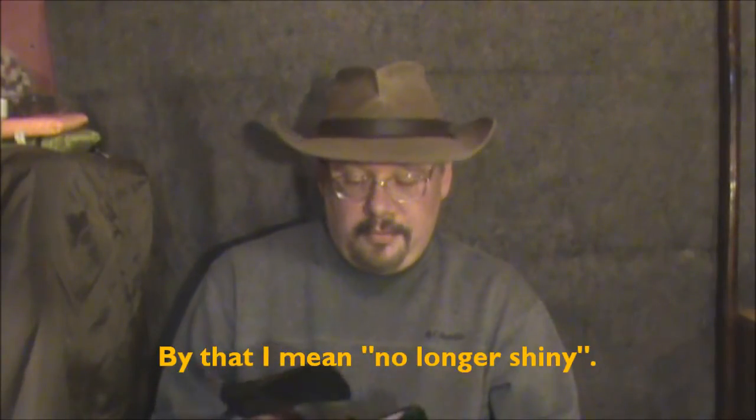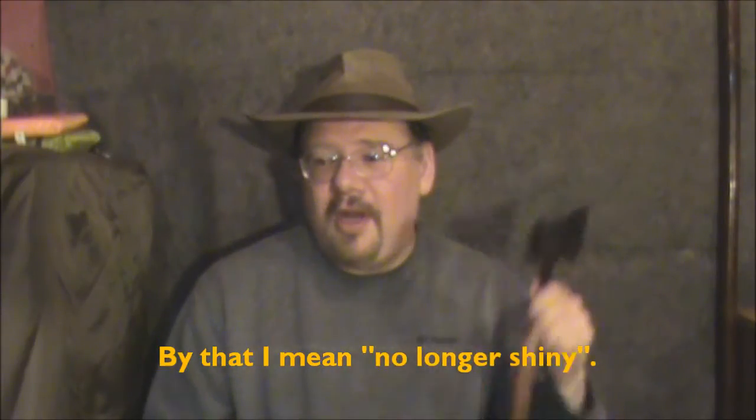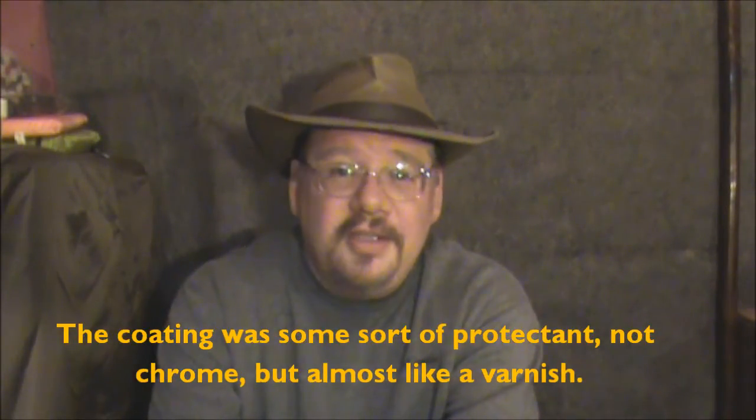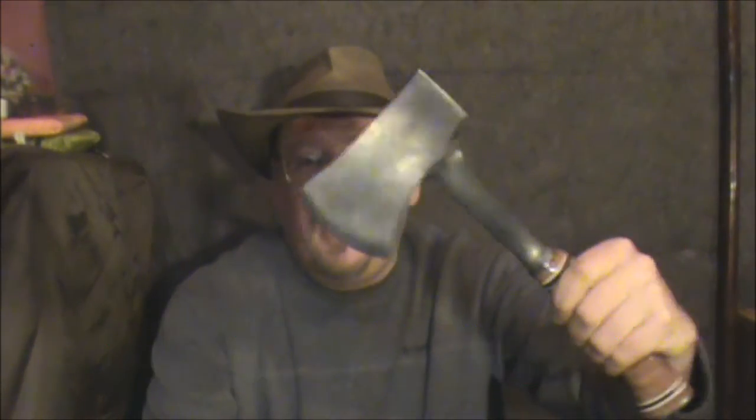The other thing I've done which is really different is you'll notice it is no longer chromed. That's because I was actually using it and found I wore some of the coating off, so I just took several different grits of sandpaper and took the coating off. You sand it down to bare metal — I started with 120 and then worked up to 180, 320, 400, and then finally 600. Once the coating was off you buff it down, take all the scratches out. 600 is a good enough grit to stop with.